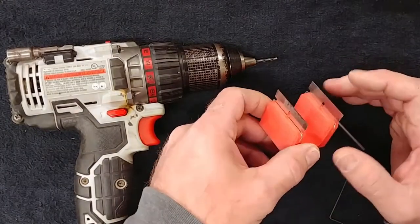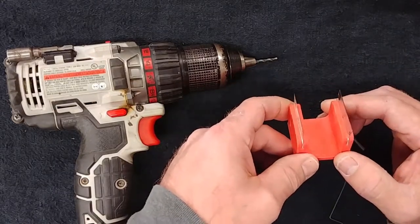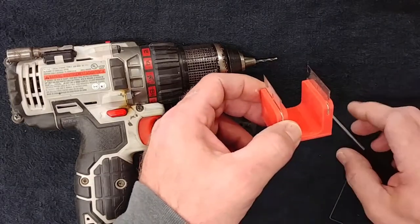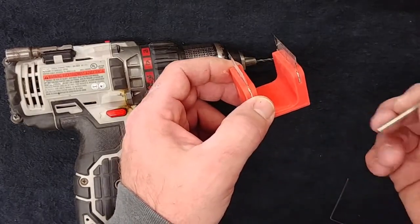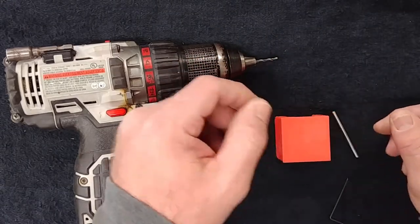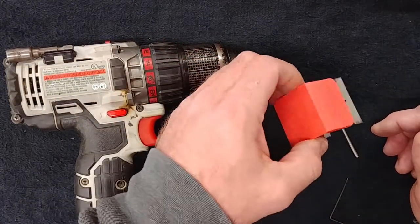It has a very smooth finish on its surface and when you use a drill rod it's less resistive on the really fine edge of a razor blade. I choose razor blades because of the fine edge — it gives the least amount of resistance. I know there are some magnetic balancers out there, but I have yet to find one that does an eighth-inch shaft, and I'm not sure how resistive they would be. So I like the razor blade method.